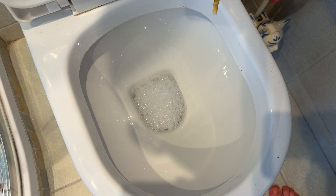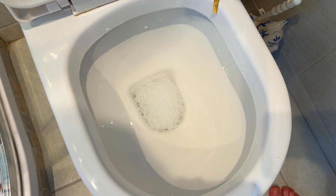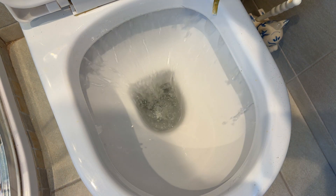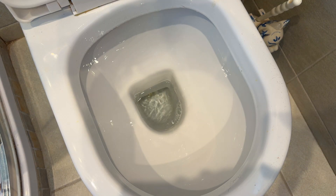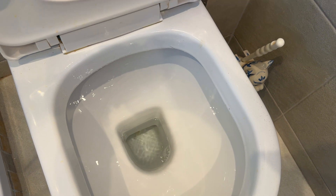Of course we've got bubbles. I can still feel a little bit of resistance down there where the water is really liming, pooling down the bottom. I'll give this a few flushes — bubbles are nearly gone. There is still some lime scale down the very bottom just in here. The bleach hasn't had any effect on the heavily pooled or layered lime scale down the bottom of the bowl. So I still need to put some acid in there — more on that later.